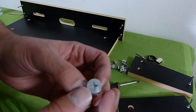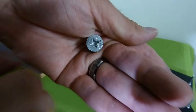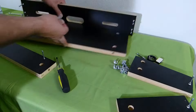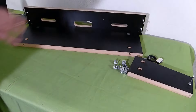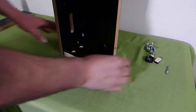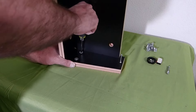Now with the cam locks, there's one thing you're going to notice — there's an arrow pointing and there's a little logo on them. That's pointing to where you're going to lay it down. You're placing it where the screw is facing, so where the screw is coming out, you're putting that cam lock straight down with the arrow pointed toward the cam lock screw. As long as you're doing that, you will not screw it up. If you put them in wrong, it will not tighten properly or you'll strip the screws. So you really want to make sure you're facing that arrow toward the screw and you'll have no problem at all.